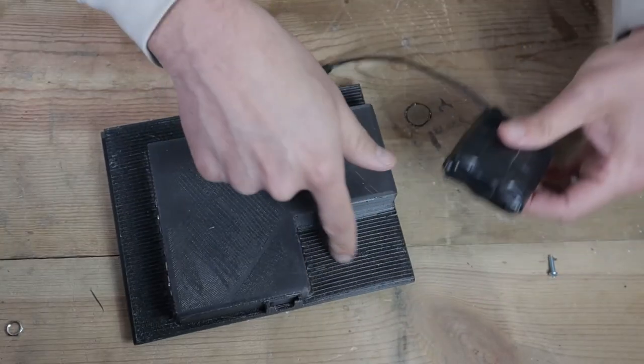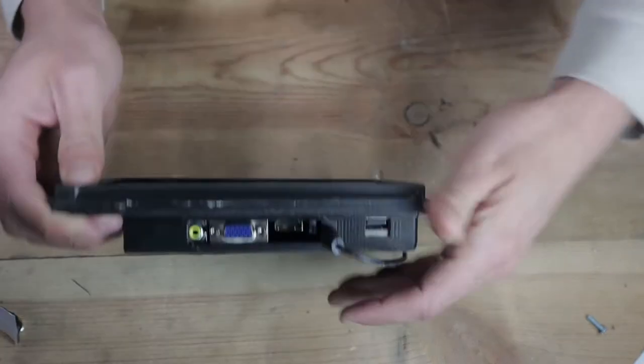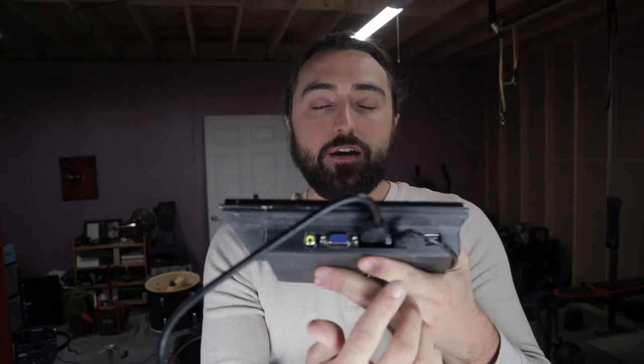Okay, so here's the finished battery. I'm just going to secure this with some Velcro so it's nice and removable. The battery's stuck on, now we can give it a test drive. It's getting power — look at that. So it looks like this is working. I'm going to hook it up to this camera. This is a Canon M50 with an HDMI to micro HDMI adapter cable. Plug in the HDMI — this is me looking at the screen. So yeah, this is totally working. The other cool thing is I put the USB port on there so I can use a power adapter for the camera. This is a simple power adapter and dummy battery for a USB plug, so I can plug this into the monitor and it goes into the camera. That way I can use this nice big battery in place of the smaller Canon M50 batteries. You can also power things like lights or a USB microphone — anything that takes 5-volt USB can go right onto that monitor.